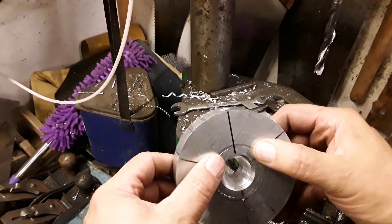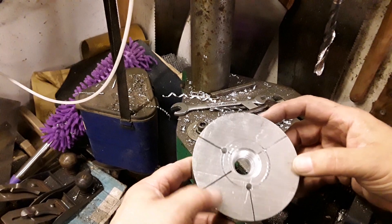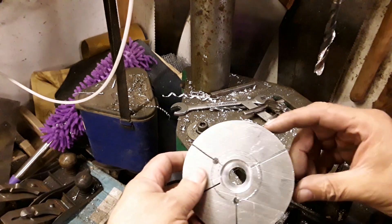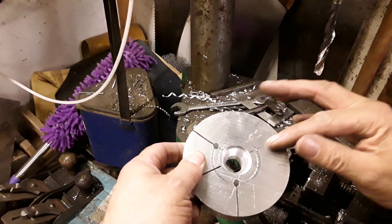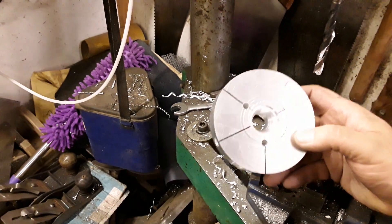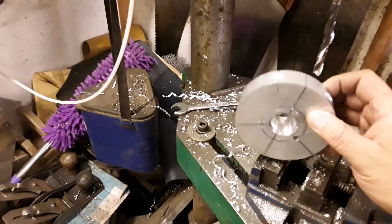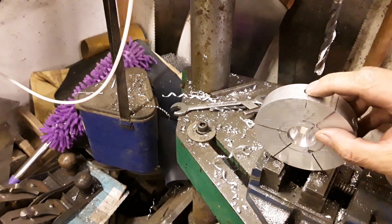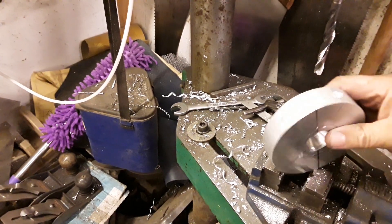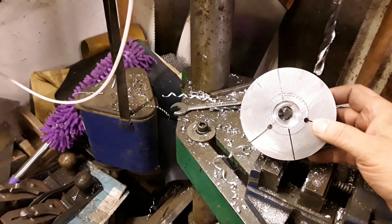There are two relief holes in this side where the single handle is, then the double handles are on this side. When you cut - relief that and relief that as I've done on the bandsaw - these two handles then close this side together once that side's cut, but I won't cut that until I've actually finalized the central hole. That's basically how I do it and it doesn't take very long, maybe an hour to do each one. You can do those holes just starting off at an angle, come up to vertical, then finish off vertical on the drill to get them perfect.